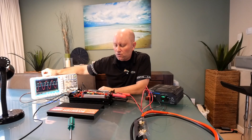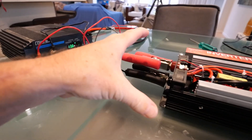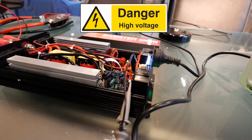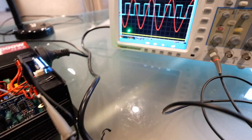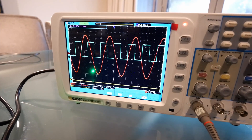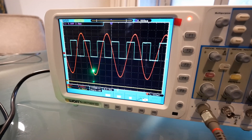Overall I'm pretty impressed — it is what it says it is. Here's a close-up: you can see the power supply at 13.6 volts, same as if it were on a battery, powering the inverter with the cover off. Be very careful doing anything like this as that is mains voltage. Looking at the oscilloscope screen, you can see a nice clean red sine wave — quite impressive. Just ignore the bluish square wave behind it; my oscilloscope has been doing some funny things lately.